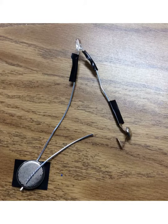The next step will be making sure your battery is attached to your circuit. Get a piece of electrical tape with the sticky side facing up, then put your long aluminum wire right on top. On top of the aluminum wire, place the positive side — the flat side — of your battery, so the bumpy side is facing up. Then place the last piece of wire on top of the negative side of the battery, and cover up the battery and the wire with another piece of electrical tape, making sure it is very secure.